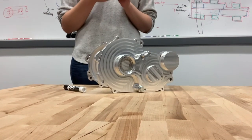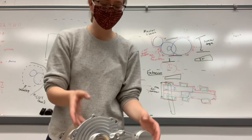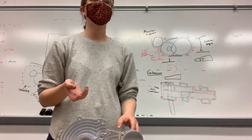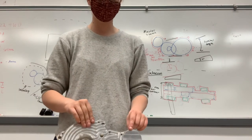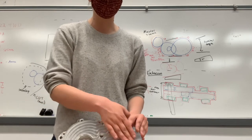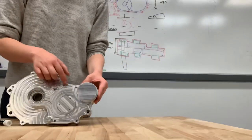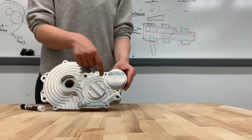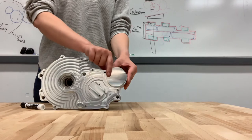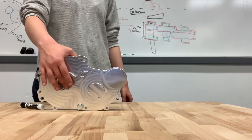Additionally, put in tools at points where you think it might be tight. You can download tools from the manufacturer's website. On Tripp's gearbox, you'll notice this piece here is a Mickey Mouse shape — it comes out and these bolts are on this surface rather than on the bearing surface, because the bolt heads can get down here. In the other design they couldn't, so you bump it up to the next surface, and that tiny bit of extra material is worth the benefit.